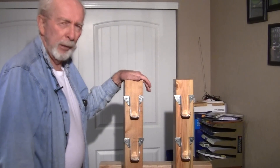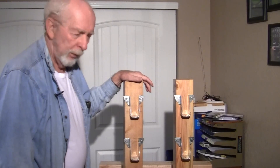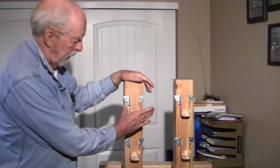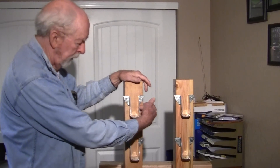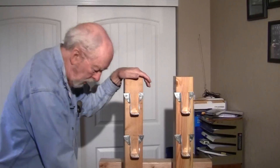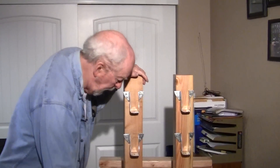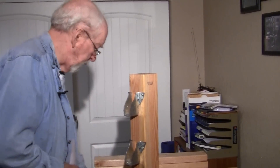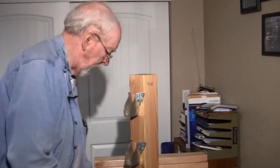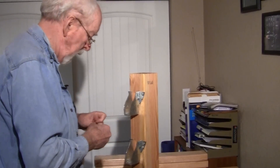There's an old saying in my family — nothing is ever easy — and that's proving true here. The holes inside the 2x4 hangers aren't big enough for the bolts; when used for construction they just drive nails in, but I'm not doing that, so I'll have to drill them out. I'm also marking each of these legs to indicate where they go under the desk so I can keep track of which side the 2x4 hangers have to go on.